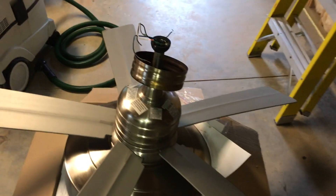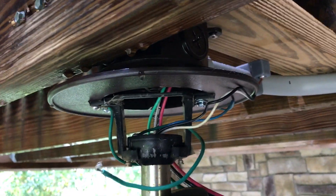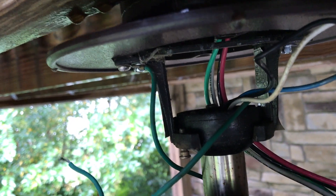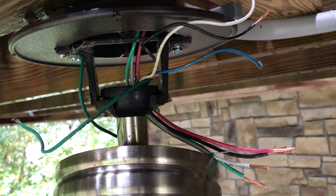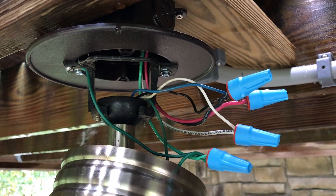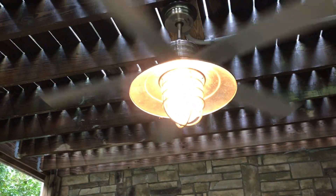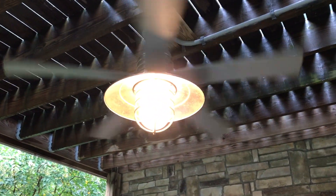The old fan is cleaned up and I've cut off and re-stripped the wires to make the new connections. I've lifted the fan, set it into the mount, and rotated it until the groove in the ball contacts the tab on the bracket — and there we go, it's seated in place. Now I make up the connections using exterior-rated wire nuts — it may be a little overkill but it's good reassurance. Here we are — this is the finished job. Everything is installed, the fan is working. All in all, it's a good result. Thank you for watching.